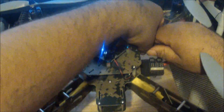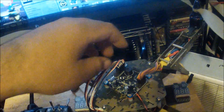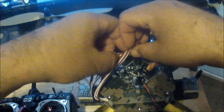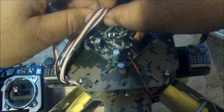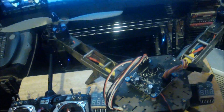There's one more thing to do. Unplug the battery. Now that the aircraft is calibrated, since you don't need to calibrate the board anymore, you have to unplug the cable coming from the fifth channel on the receiver from input number five and move it to input number six.